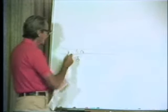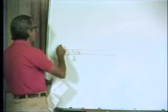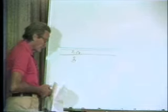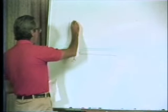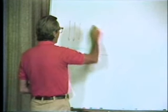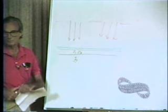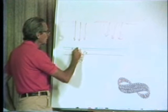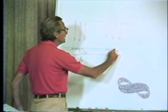Now, on top of this, the next layer, we put on another chemical, which is evaporated on in a thin layer, which is called a photoresist. And then light is shone on here. Light comes down, let's say like this, in a pattern. No light here, and only light here and here, because it's an optical system. It's a picture. In other words, a black and white picture is projected on here. And what the light does is make this material resist etching later, or rather dissolving it off. So it gets to be resistant here, where the light's shone.